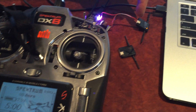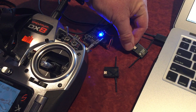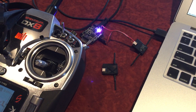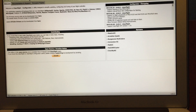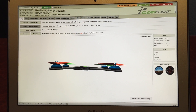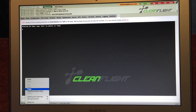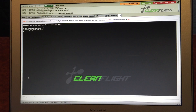DSM2 2048 is confirmed and it's working. We're still going to have that brownout detection — the slower flashing — which is how you confirm it's in DSM2 mode. The next step is the actual DSMX modes, which are values seven and nine. DSMX is a frequency hopping protocol which is better and has faster reconnect times, but you do actually lose the brownout detection, which I'll demonstrate once we get it bound.